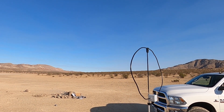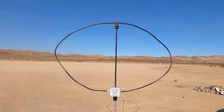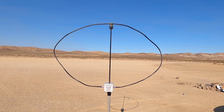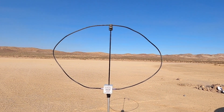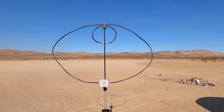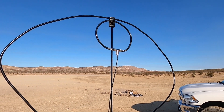Let's go ahead and take a look. For doing 10 to 40 meters, you will use the shorter loop and you will attach it to the top of the coax holder at the top of the bar. After the large loop, you put the center feed loop on, and then the last thing you're going to want to do is hook up your coax cable.